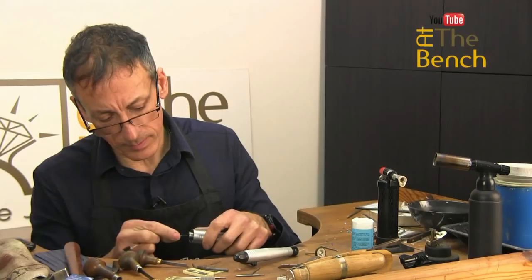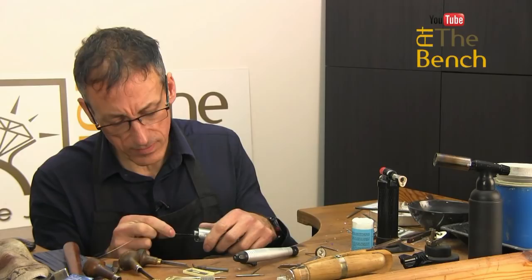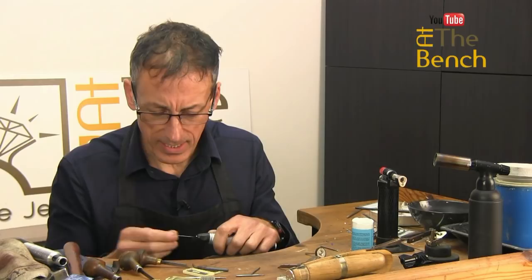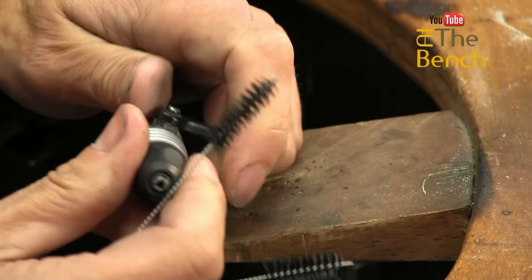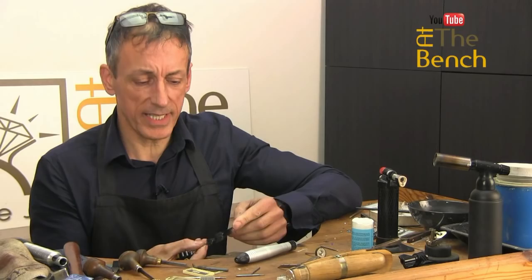So there's all those little bits of polish, little bits of metal that will actually stop that drill from being completely centred within the chuck. It only takes a fraction of a millimetre on one jaw — a little bit of polish that gets caught — and it's not going to keep that drill central. It's going to keep it slightly off and you're not going to get very accurate results. So my little tip: occasionally, every month or so, clean these little areas. Clean the chucks on all your pendant drills, your flex shafts or your Dremels to make sure they are nice and clean.